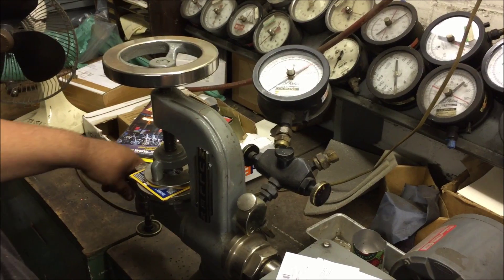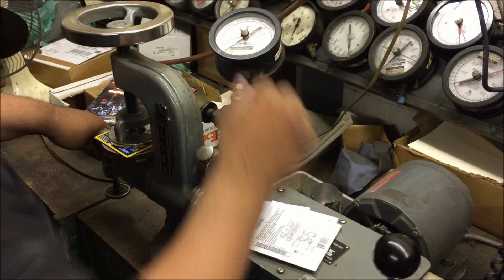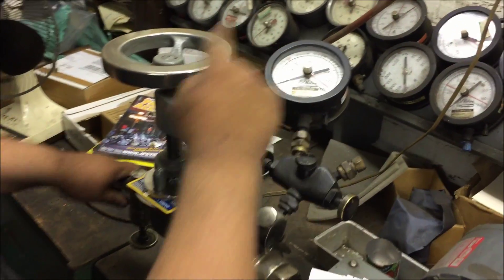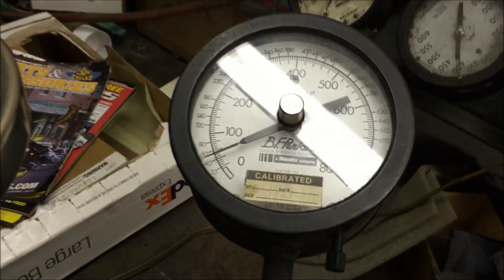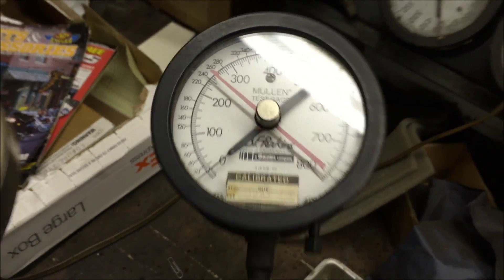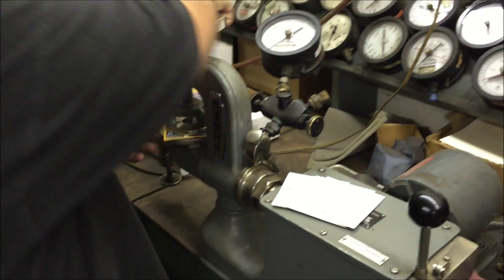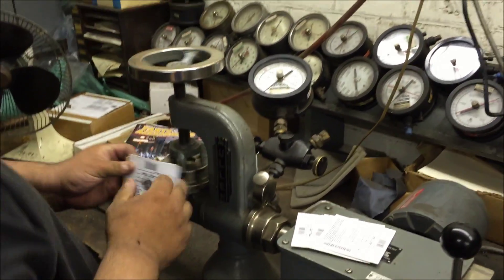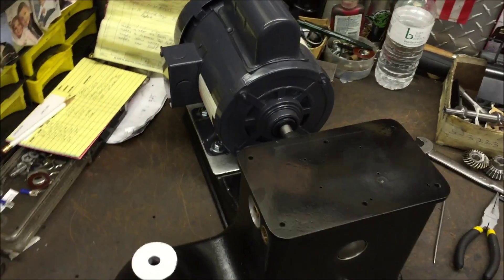They've got to know how strong the fabric is, how strong the leather is, how strong everything is. So we're at zero and the tester is going up — boom, when it bursts. See how it's still going? There's your maximum. My reading is about 250, which is about what I was expecting with three tickets at 75 to 80 pounds each. That's how you run the test.